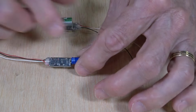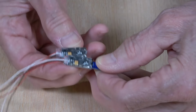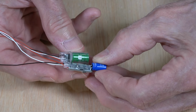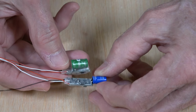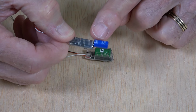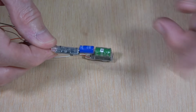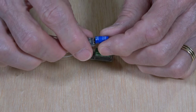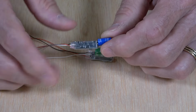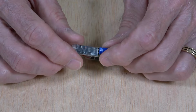So this is the Power Bridge 2. And basically it appears to be the same circuit board, but with the supercapacitor located in a different arrangement. On this one it does say that it's a 2.7 volt, 1 farad capacitor. So that's pretty good. You got 1 farad, and again, this circuit is going to boost that 2.7 volts up to something greater than 10 or 12 in order to operate your locomotive and to operate the sound circuits.